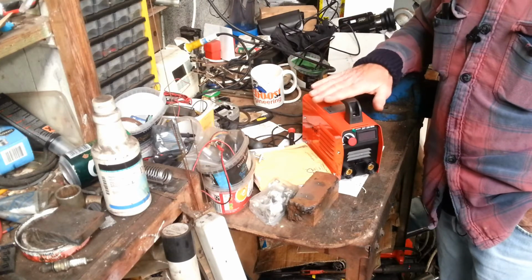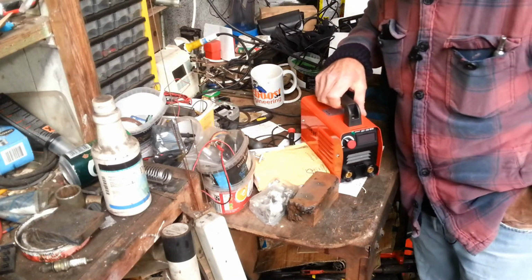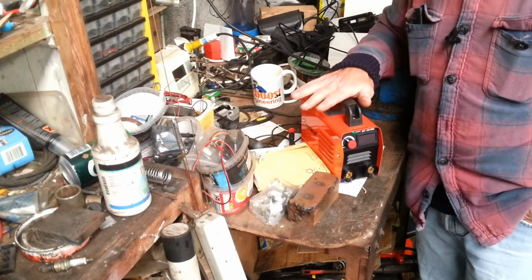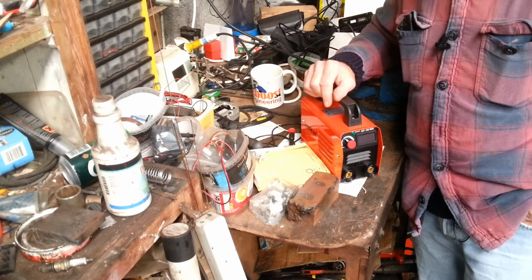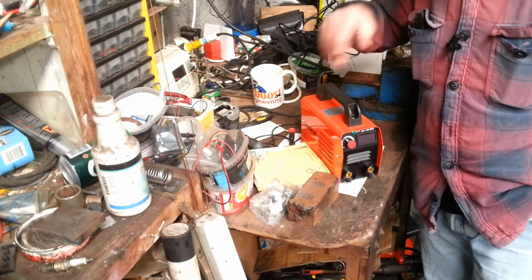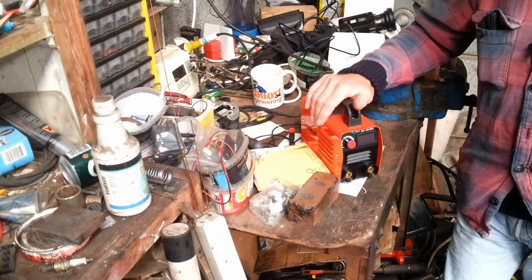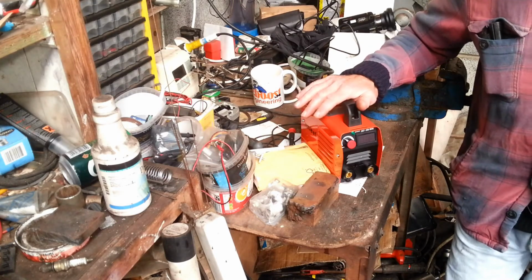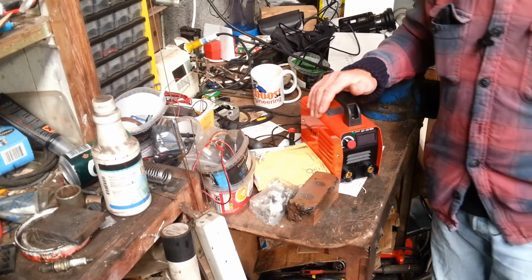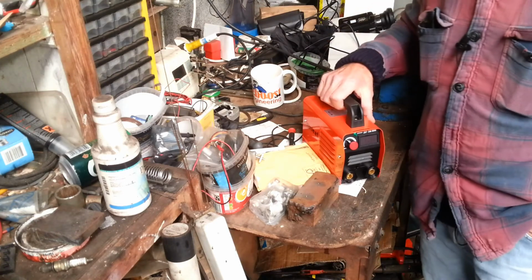Now, I hadn't intended doing the video on this thing, because I'm actually trying to do something on just the repairs to the machine out there. But I've been impressed with this thing. Now, I was welding that roof. I just cut the whole roof clean off and put on a frame. I think it's 3 or 4 inch angle, and then I'm welding this 1.25 millimeter plate. It was what I had. I probably should have gone away and got something, but yeah, this will do it. I mean, I don't go out and hire anything, just use that machine around the farm. So once it's dry, it's fine.